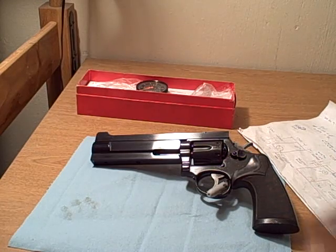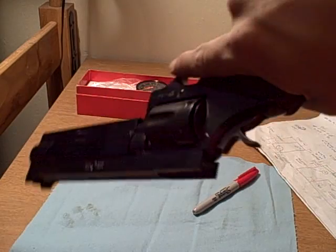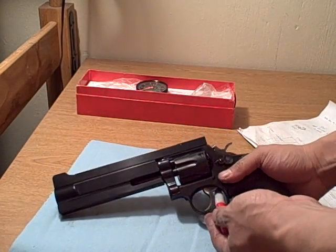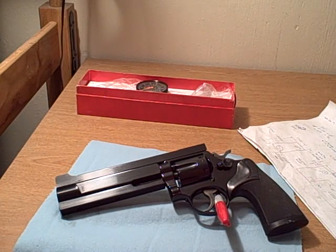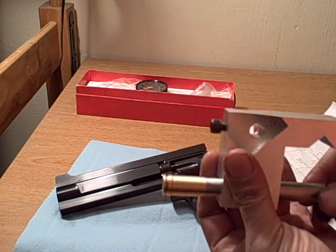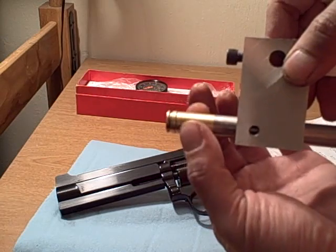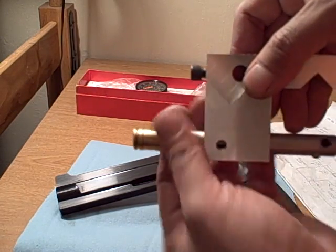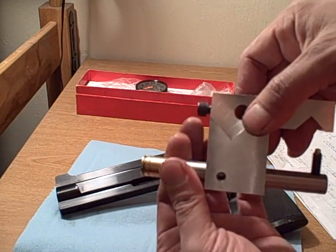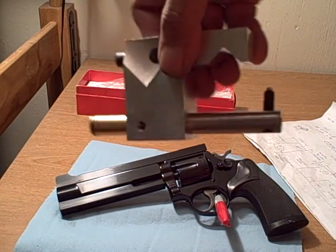Anyway, I hope you like it. I'm really happy with the way it came out, and I can't wait to go shoot it. I really like the heft — these are heavy just by design — but with all the slabbing and everything, it's actually not too bad. It points really well. I'll show more videos of stuff I'm doing in the next couple days. Everything's due by Tuesday, so I will hopefully have everything done by then. Oh, the handle — I don't think I explained this. The handle is actually a 7mm casing that I stuck onto the end of this. I turned the inside of the rod down to the inside diameter of the casing and stuck it on — it's soldered on there and then turned on a lathe to be smooth. That's just the handle; it's decorative. You need some kind of handle, and for what you're using this for you don't need a lot of pressure. I went with a more decorative handle — I'm going to be a gunsmith, so it's kind of nice having something that looks like it belongs on a gunsmith's lathe.